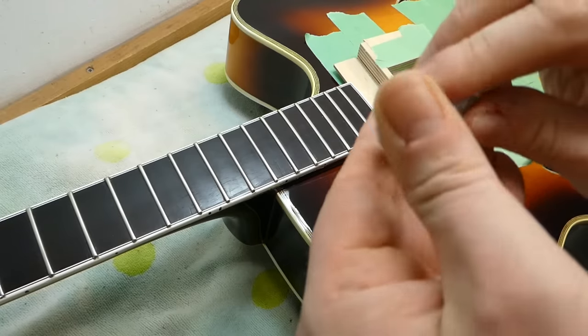Made up the wiring harness. For F-hole guitars, the object is to emphasize keeping things straight and compact and, if possible, building in some strain relief. Here I'm using a dab of super glue to hold the spiked washers in place on the pots. Positioning the components inside the guitar involves wrapping fishing line around the tops of them and pulling and cajoling as well as you can — it takes some patience. I've learned over time that it pays to make the connections for the pickups accessible through one of the openings, so that in the event someone wants to switch them later, you don't have to pull out the entire harness again — you can just desolder them there, put the new pickups on, and save yourself half a day.